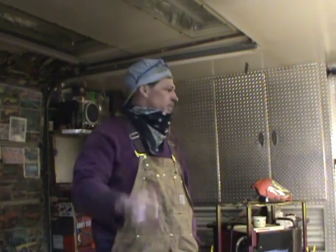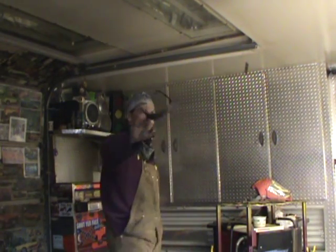Cover your hands. Try not to be in a hurry. Wear a full shield too, not just safety glasses. This is all I wear when I plasma cut. When you're cutting, little sparks come up — even though it should cut straight through so sparks don't come back. But what I'm doing is just tagging the weld and letting go, not penetrating through the metal because I don't want to burn a hole through the fender. Still got a lot of grinding — it's going to be an all-day event.